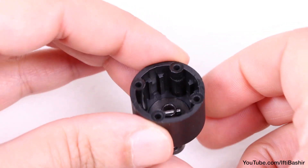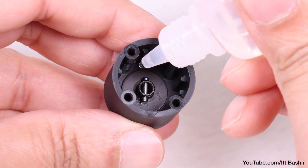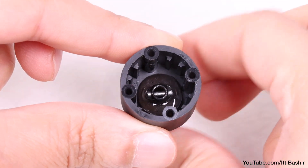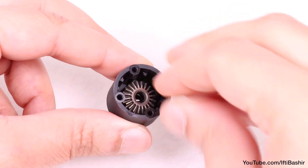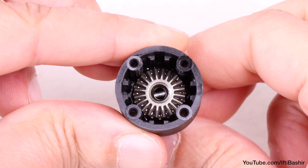The pin not only keeps the outdrive and the O-ring in position, it also fits into the groove on the underside of the larger internal gear. Likewise, the gear keeps the pin in place too, so they're effectively helping each other. I like to get a few drops of oil into the empty cup here, just enough to cover where the gear will sit, before dropping the gear into place and giving the outdrive a turn to verify the gear is nicely flush.